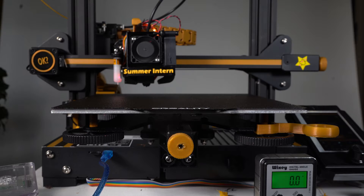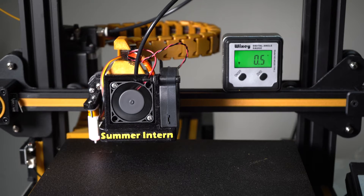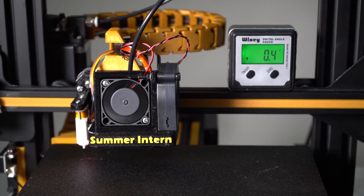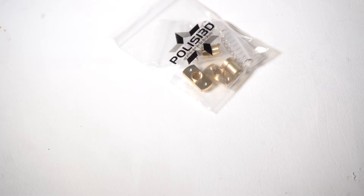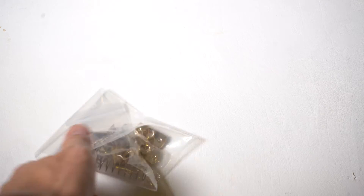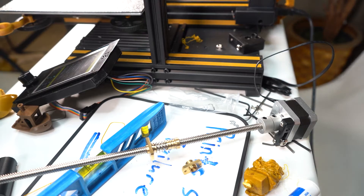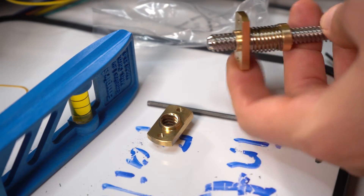So let's fix this. Before we begin, I like to level my gantry against the surface the printer is on and the bed. This helps to keep everything consistent, especially when tramming the bed afterwards, which should be done after you level your gantry. Here's the fix: these anti-backlash screws go into your Z-axis lead screws. The tension in the screw against the mount keeps it from falling down — it makes it nearly impossible to push the gantry down by hand.